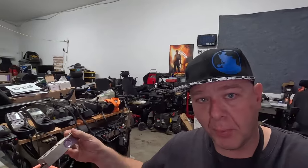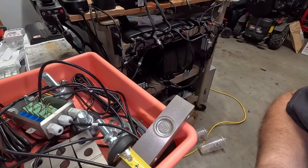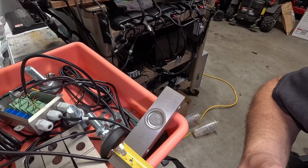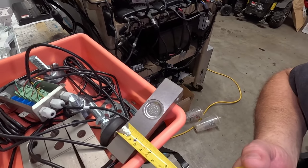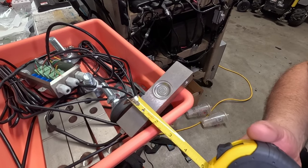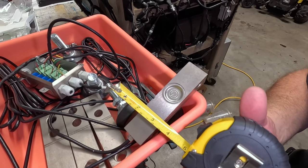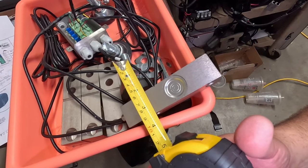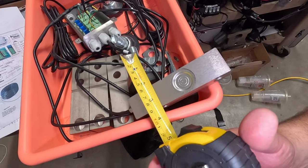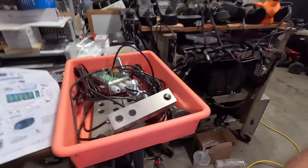Then we're gonna need to get some bolts to attach these load cells to the bottom of things. And these are approximately 1¼ inches thick. And then I'll need to go through a 2x4, which is not 2 inches these days, but according to my maths, probably 3½-inch bolts should do nicely. Oh, and we need to figure out what size these are.